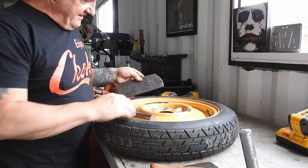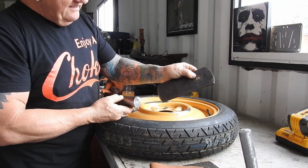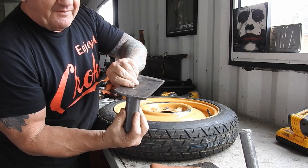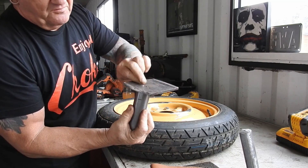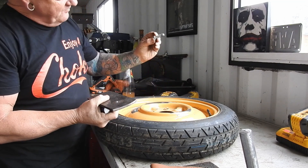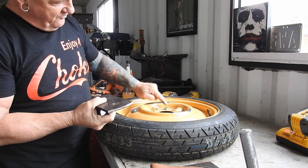We've cut our pieces to suit, drawn the hole in there in this bar, so that when I weld this onto there, I can also come in from the back and just add a bit more meat, just to help give a little bit more strength. And also in there, I'm putting two 12mm bolts and I'll weld those in.